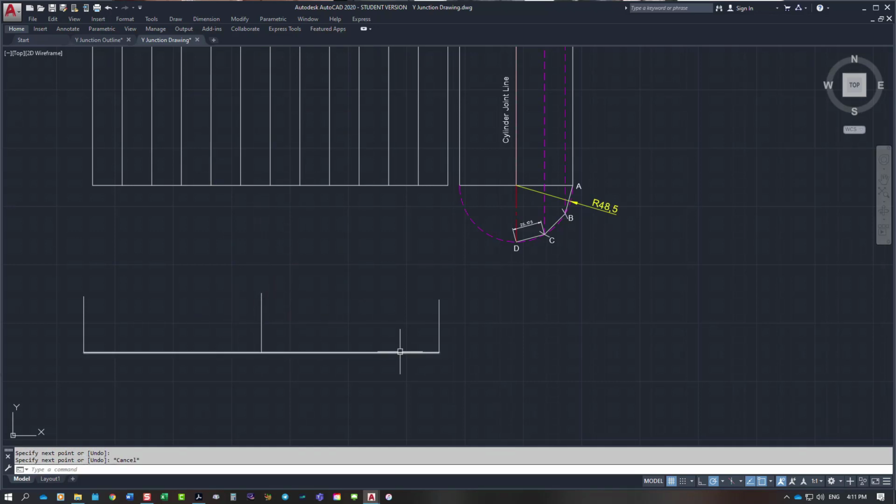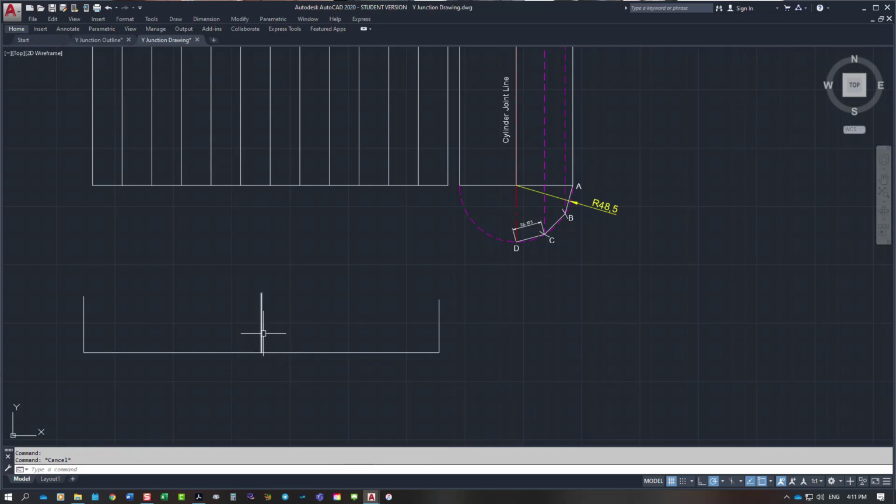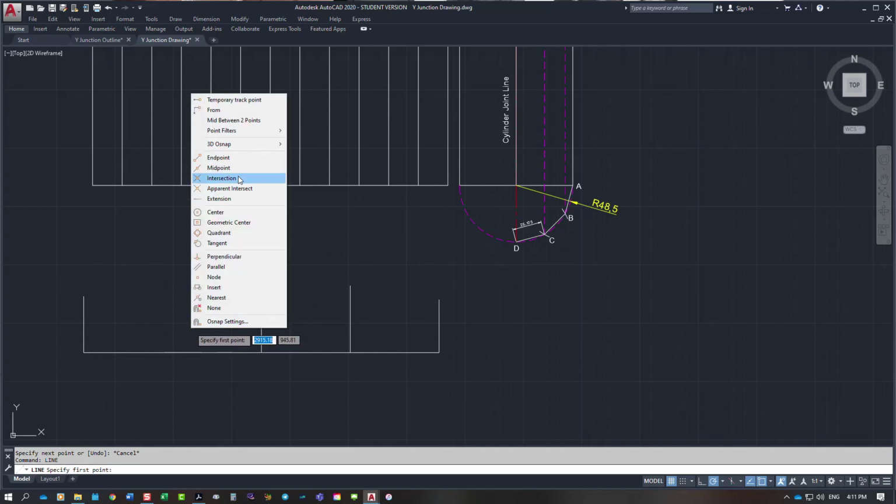Now you can just take that line and divide it in half and draw a vertical line in. And then what I would do is break this next portion between this point here and this point here in half. So how do I want to do that? I'm going to split that line, so I'm going to do a break. Pick my line, type in F, do the same again. So now I've got this line in 2 halves, and then I'm going to put another vertical line in, and I'm going to pick the vertical line from the midpoint again. There's my midpoint, and I would do exactly the same on the other side as well, from the midpoint.